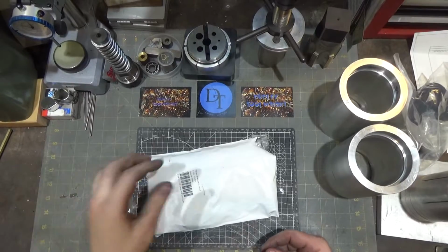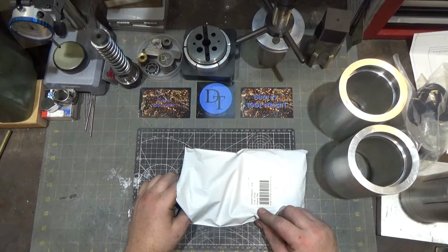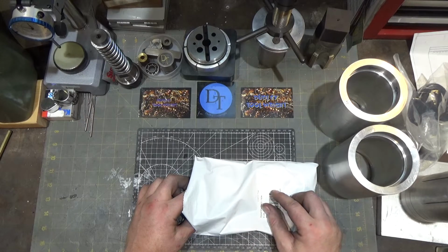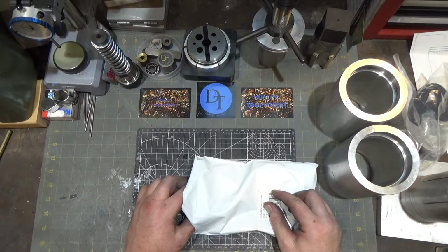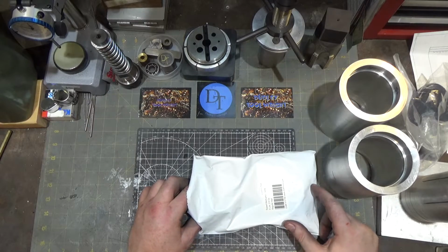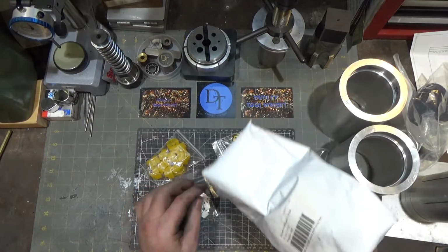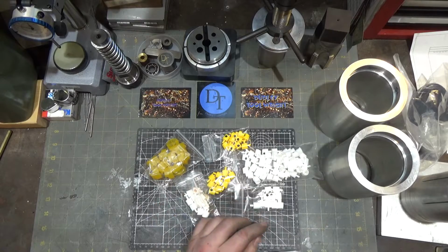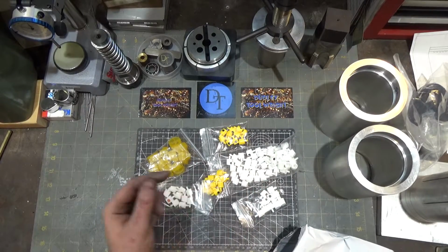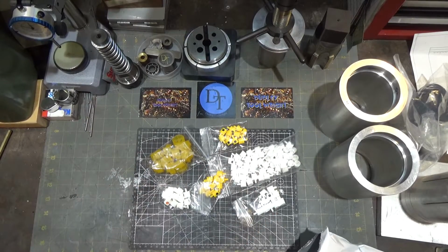It works very well. Next up is something I didn't know existed, but I guess on the internet everything exists. This is from a company called Art Primo, and you can look at artprimo.com. So you know when you're using like 3M spray adhesive, the nozzles get fouled, and Robin uses some pretty toxic solvent to clean the edges of it. It has toluene in it, and that stuff's pretty nasty. You probably don't want that on your skin. But you can buy for almost nothing replacement spray caps. And Art Primo sells them that have different spray patterns, but they also work on different style cans. So instead of having to deal with cleaning it, I know I'm not a big fan of throwaway, but this is a decent solution, and this is available.